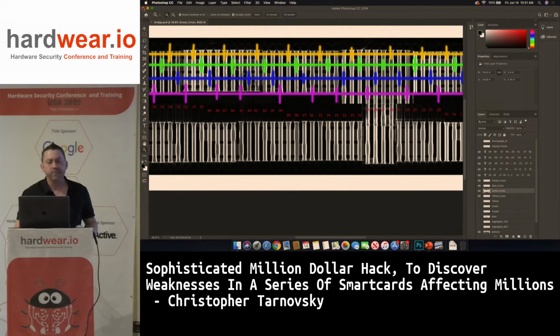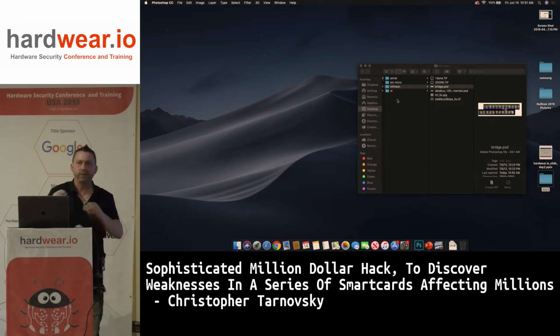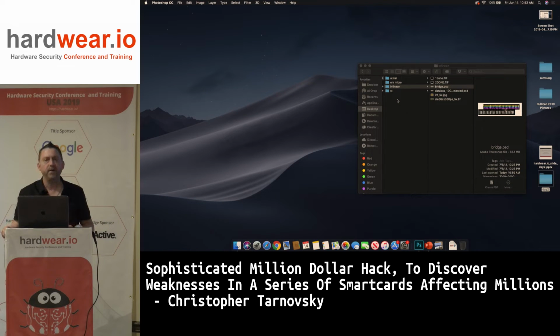So Infineon's made leaps and bounds. I'm not a big fan of their 76, 77, 78 series. I'd prefer ST over Infineon for their architecture. But Infineon's 78, I wouldn't trust it. They're bragging about how the core is split into 2 halves. And it's a bunch of bullshit. At some point in the CPU core, it knows how to add 10. Or it knows how to subtract 20. And Infineon runs around touting never at any point in the CPU core is the opcode in the clear. And that's bull. It has to execute something, it has to run code. So that's all I got.